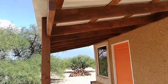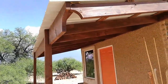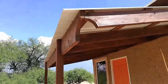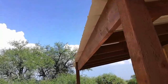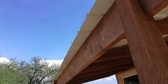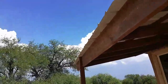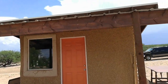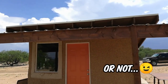I could say everything went smoothly, but it wasn't 100% smooth. For some reason, this is not 100% square — probably because I didn't make it 100% square. I had a little bit of stair-stepping going on with the panels as they were hanging over. So Yvonne and I just snapped the chalk line and I used the angle grinder and cut it so that it's even all the way down. Once the gutter is up and the downspout for the rain collection, you're not going to see it anyway. Otherwise it's all buttoned up, and I'm going to get the trim pieces on Monday.